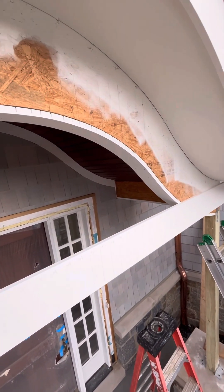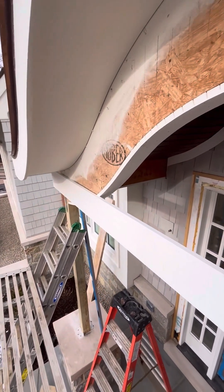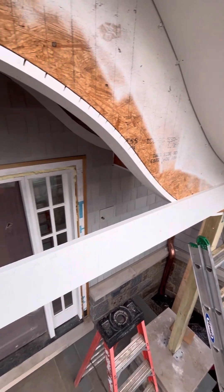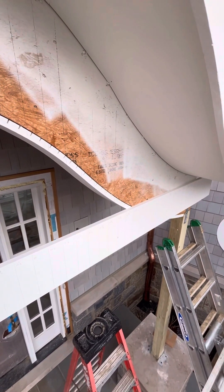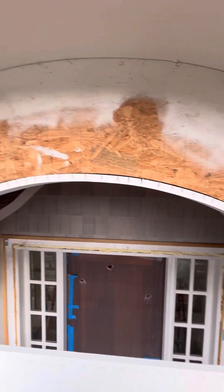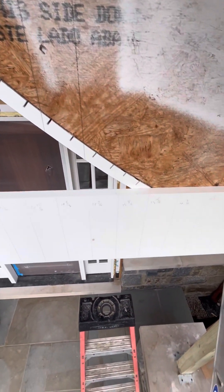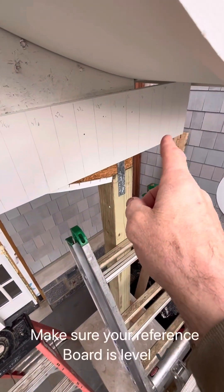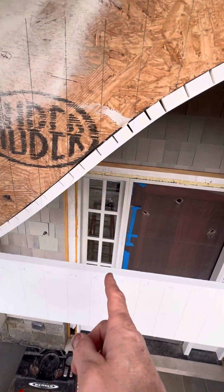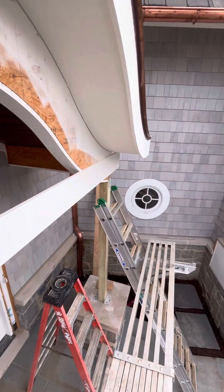Here's a system you can use when you have to match the profile of some kind of curvature and you don't have the radiuses. The difference between when we framed this and when we came back to put the finished trim on has been like seven or eight months, so the radiuses I had laid out on the interior of the house are gone. We have to manually do this — put a board on, marked out at two-inch increments, and then plumb up and write the number for all of these.